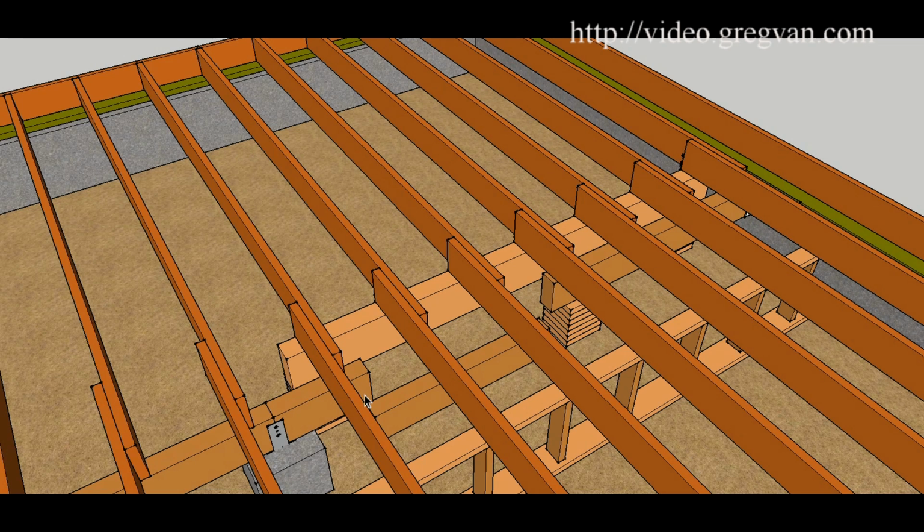You can leave the nails that are holding the beam up for a small section. Small section, I would say less than 2 feet. The nails are going to hold that up most of the time. But don't be surprised to find some of this stuff that it's not nailed either. I actually came across a floor one time that there were no nails. Hard to imagine, but there were no nails holding the joist to the beams.